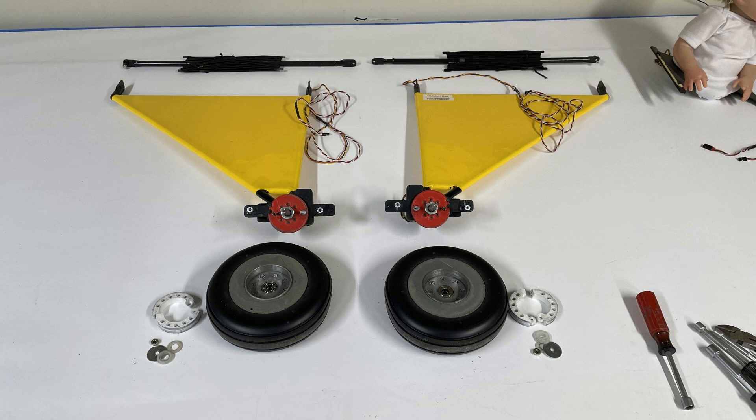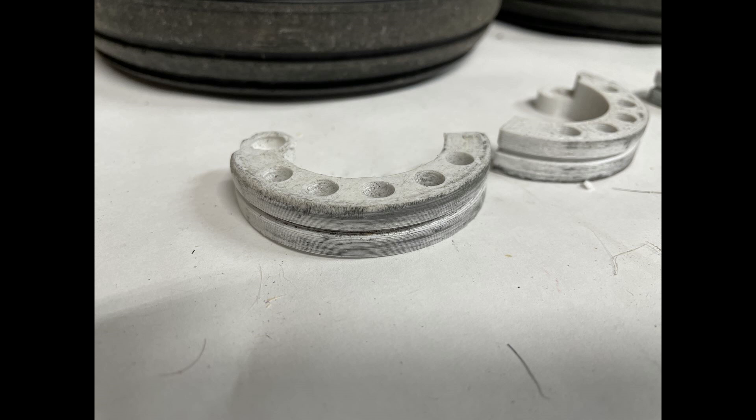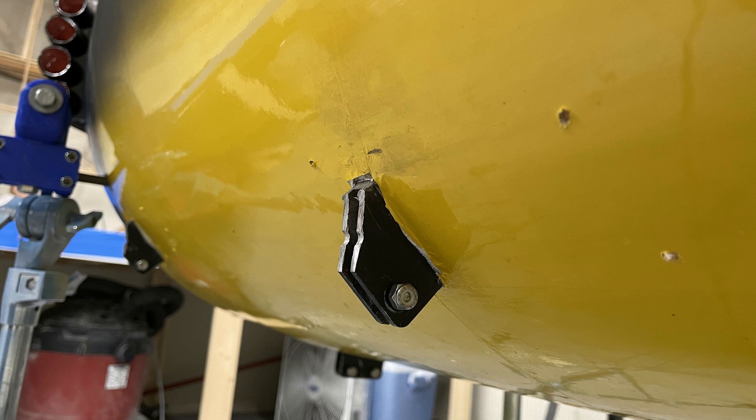Here is the entire landing gear system — basically everything that makes up the landing gear, excluding the tail gear. Here's what the brake shoes looked like after one season — they're not worn down too much. There's a rubber band that holds them in place so they're not always rubbing; that's what the groove in the middle of the shoes is for. Here's the hard point — these are aluminum, connected to hardwood. That's the only hardwood in the whole airplane. Everything else is balsa wood, a little carbon fiber, and a little bit of plywood.